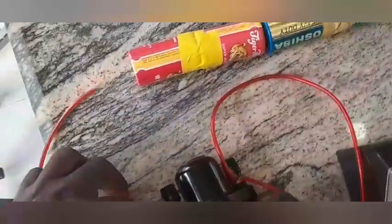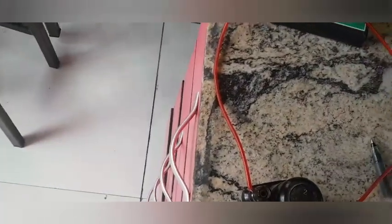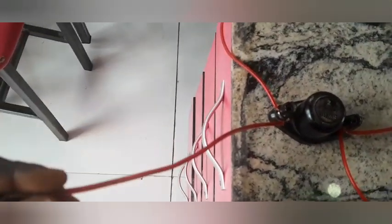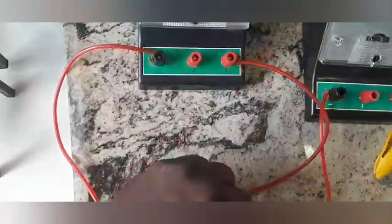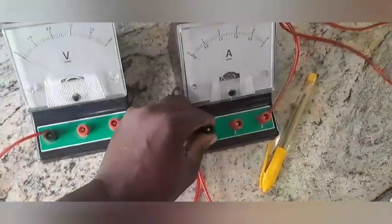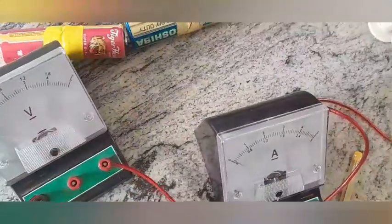This is my setup: the batteries are joined together with hard wires. The voltmeter and resistor are in a parallel combination — there's a wire from one end down to one terminal of the resistor, which goes to the negative terminal of the battery. Two wires from the other end make the voltmeter parallel with the resistor. That connection goes to the negative terminal of the ammeter, while the positive terminal of the ammeter goes to the positive terminal of the cell. Very simple practical.